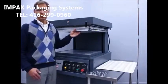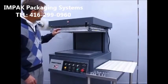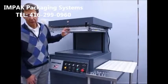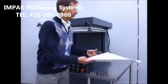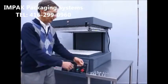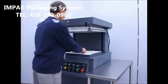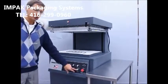Once the film is properly threaded, products can be loaded. Prior testing should ensure that once the cycle is started, the heat film timer should be adjusted so that the film drapes approximately one inch below the bottom of the film frame. At this point, the board or substrate is loaded onto the vacuum platen and products are loaded. Once products are loaded, the green cycle start button can be depressed and the cycle will begin.